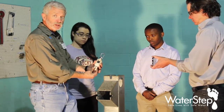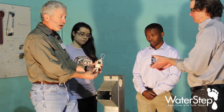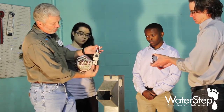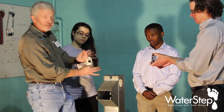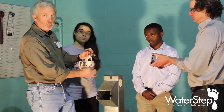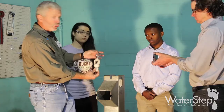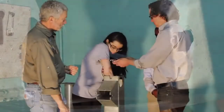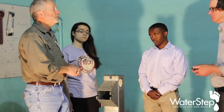So this is our bottom check valve or foot valve. We've done our inspections and now we need to put it back in the well — this is the first thing that goes back in and it's the only thing you ever intentionally drop down the well. You drop it down; these four pins go in and will either settle down or may even snap in place. Make sure the loop is up so you can retrieve it. Reach your hand down to get it starting into your rising main, then release it and it slides down, possibly hitting the water before settling.